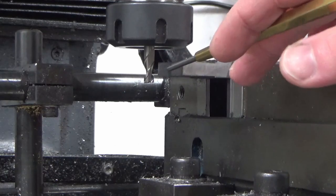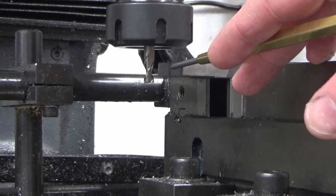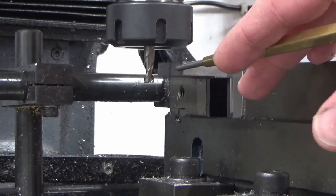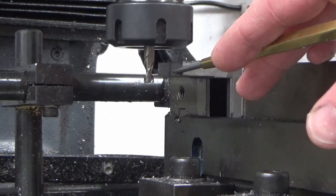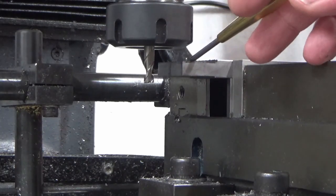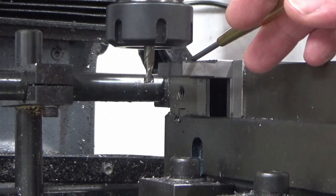So what we're going to do is, I've got a 6mm slot drill here. Even though I've machined this end with the carbide end mill, we're just going to take a very light skim over here. I'm going to set my DRO at that point so I know where this edge is. We're going to use this to plunge my two screw holes in, because I'm using M6. So I just plunge straight through with the slot drill. That should get me a good enough clearance hole.